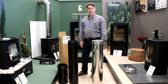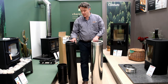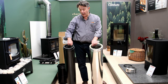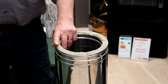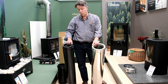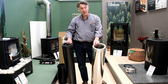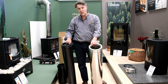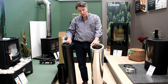It's going to get hot — 300, 400 degrees C. Now, there are two basic types. There's a closed unit, which you can see here, that has like a cap on the end, and there's an open unit. The closed units are generally slightly cheaper and easier to make — you just block one end and fill it full of loose rockwool. The open-ended ones are slightly more difficult to make because you have a completely separate internal liner from the external side of the flue.